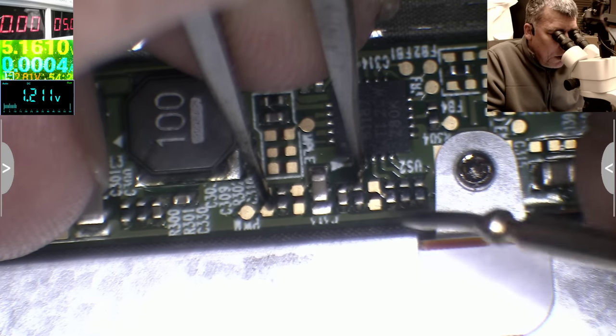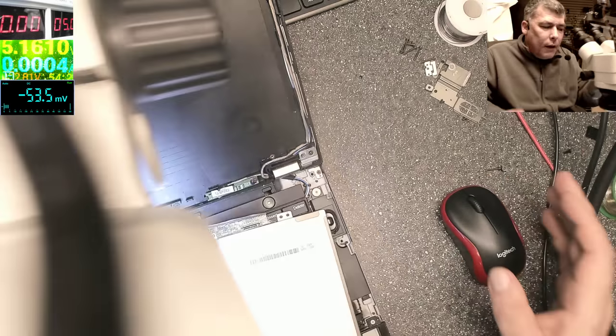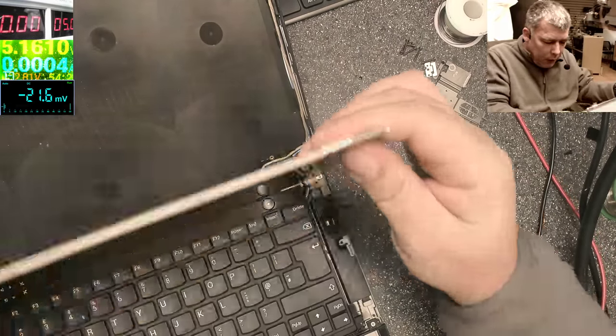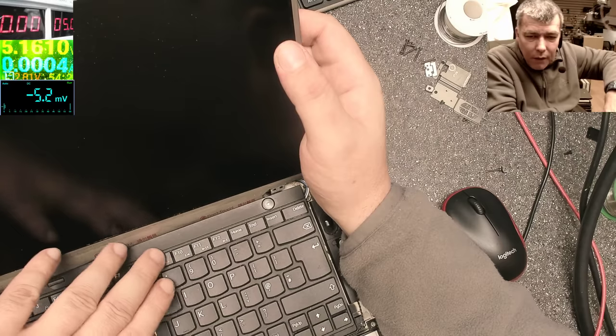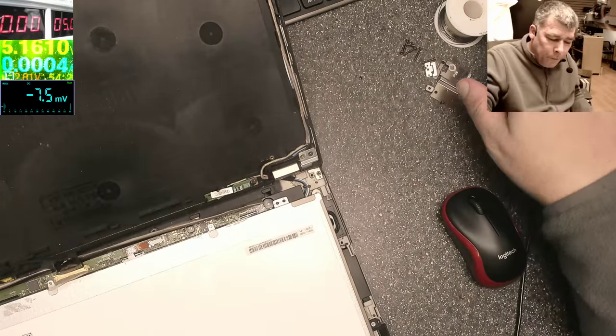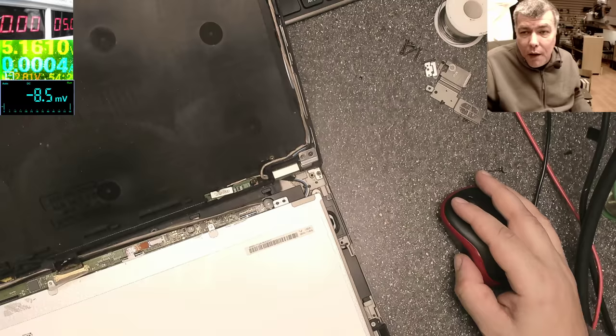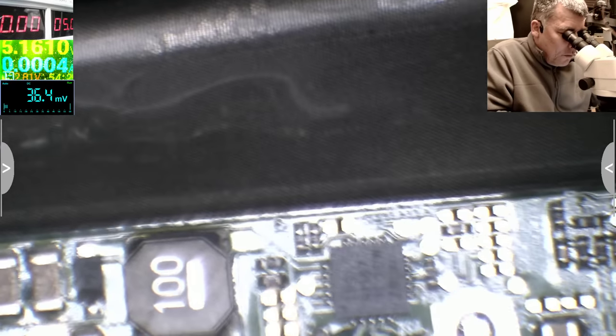Okay, so this track is shorted to ground, probably by the Super I/O. That's the case when, let's say, the dim is completely off, but I can't turn it on. FN, no, it's not working at all, so I cannot bring up the brightness. So what I will do, I will pull up that track and the screen will always be bright. Because what you can do is just open the laptop and replace the Super I/O, because that output of the Super I/O is not doing what it's supposed to do. It's kind of pointless, don't you think?